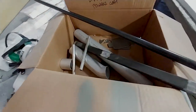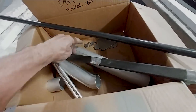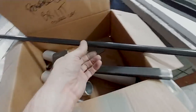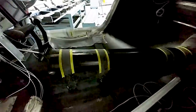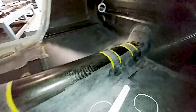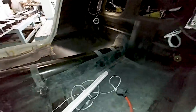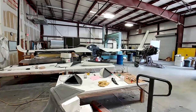Here are the new bell cranks for the elevator controls that Brit needs to weld up. I've also got a couple of rods for the elevator actuators — I'm going to put them on the lathe and draw one end out so I can tap it; the other end's already done. The other little things there are for the intake. Here I'm getting ready to put the seat mounts in along with the seats. I've put down masking tape and sanded over the keel to get rid of the shininess so we can bond the seat mounts in. It's pretty exciting to think we're actually about to put the seats in and they won't be coming out after that — that's a bit of a milestone.